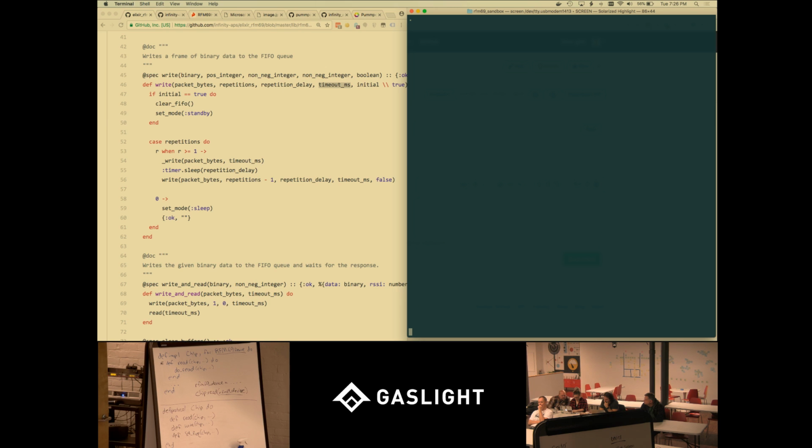So, send me another message. I'm ready for more messages. And it's sending packets across. So, yeah, so the RSSI, typically for what I'm trying to do, practically speaking, once you get around -85, it stops really being reliable. -60 is usually pretty good. So when we're literally right next to each other, that -20, I haven't seen that before in actual usage with these pumps, because the pumps aren't tuned to a particular frequency very well. They just kind of spray across the potential band that they're talking on, and they don't have a lot of range.